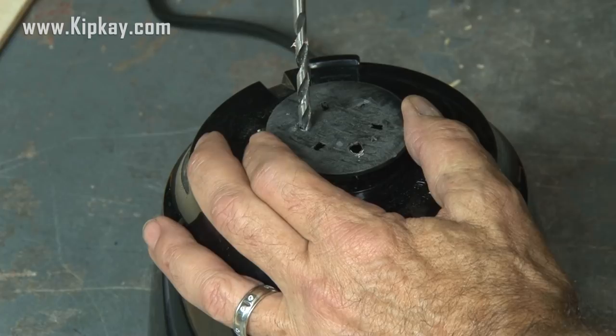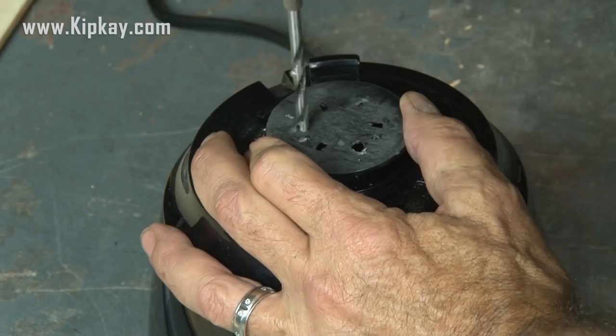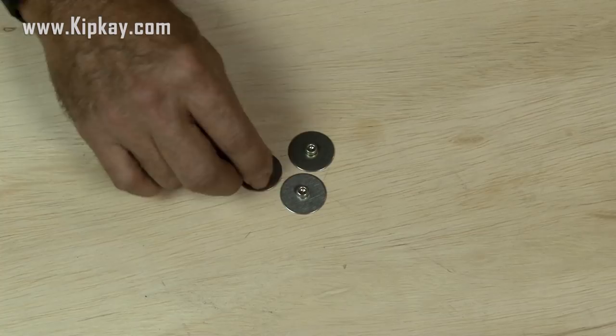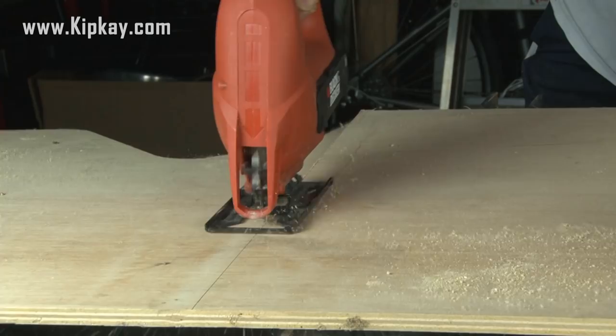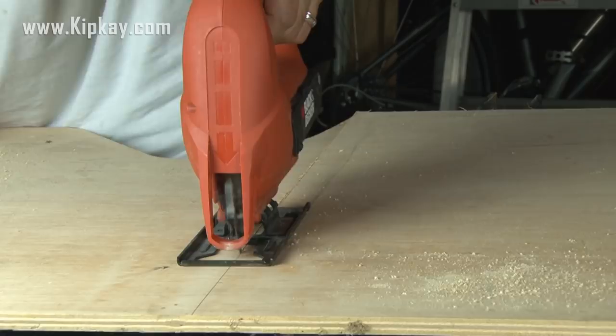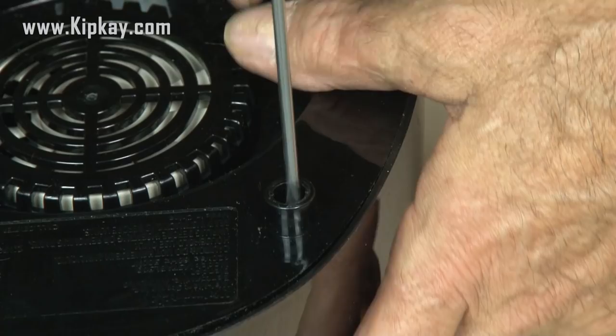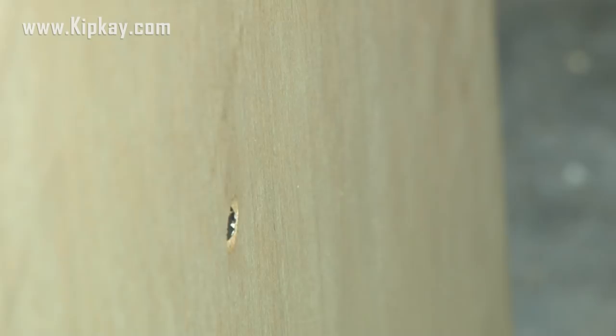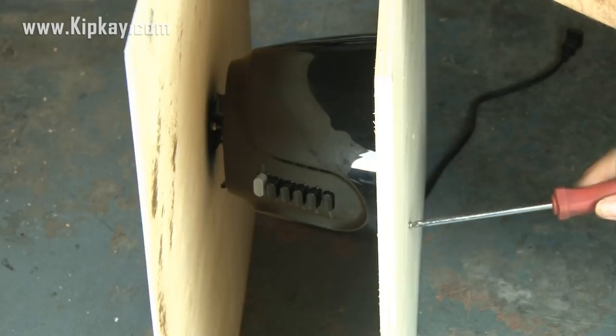After using our wood platform as a template, I went ahead and drilled three holes in the top of the blender gear. Using a set of screws, washers, and nuts, I'm going to secure the wood platform to the top of the blender. Once that's done, it's time to flip over our blender, because we're going to need a base so this thing doesn't hop around when it's spinning at high speeds. The base will be 1/2-inch plywood, so I cut a piece out of scrap that I had in the garage — also 24 by 24 inches square. With the blender centered on the top of our base, I'm going to use a pencil and eyeball some marks where the little screw holes are that hold the plastic housing together. I'll remove those original small screws because they're going to be replaced. I've drilled four holes in our base and countersunk those holes so the screws go through and allow the base to lay flat on the ground. I'll tighten those four screws, holding the wood to the base of the blender.